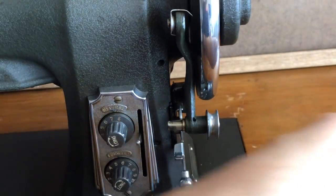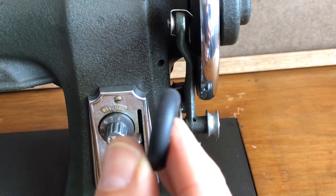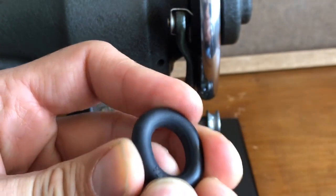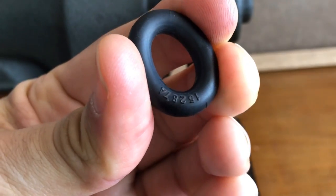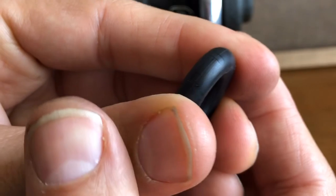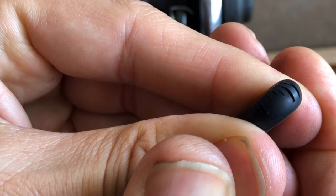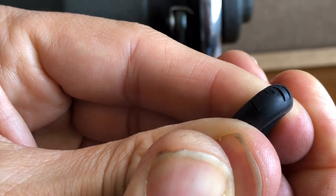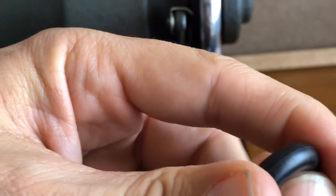It was that old. Now, sometimes you may see a bobbin tire that looks like it's in much better shape. This one does. In fact, it's a lot softer than the one I took off. This is one I took off of another machine as well. So watch what happens, guys, when I squeeze this one. You guys see the little cracks forming? This one is not as old. It's not as far along in its degradation as a piece of dry rotted rubber, but it can happen.